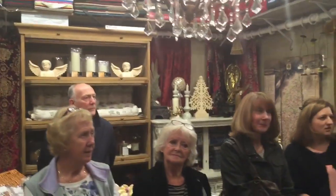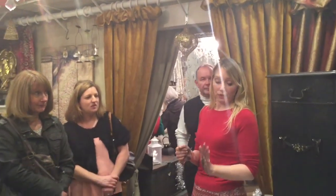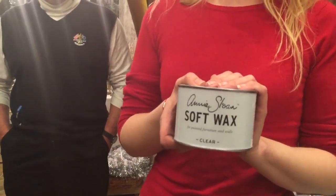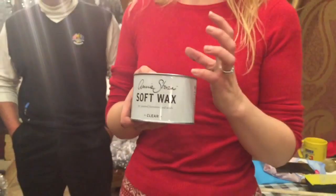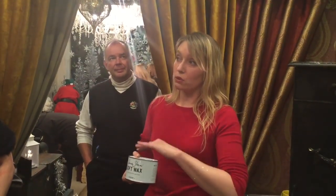Would you wax or lacquer, which one would you use? I wax, and I love using - there are two waxes that Annie Sloan does. There's the clear wax which you would always use to seal in your paint; it bonds with the chalk paint so it just holds it in place. The only time you wouldn't use it is if you're painting garden furniture, because the wax will lose its bond with the paint. But if you don't wax garden furniture, when the weather gets into it you'll eventually get that beautiful French rustic, slightly peely look.